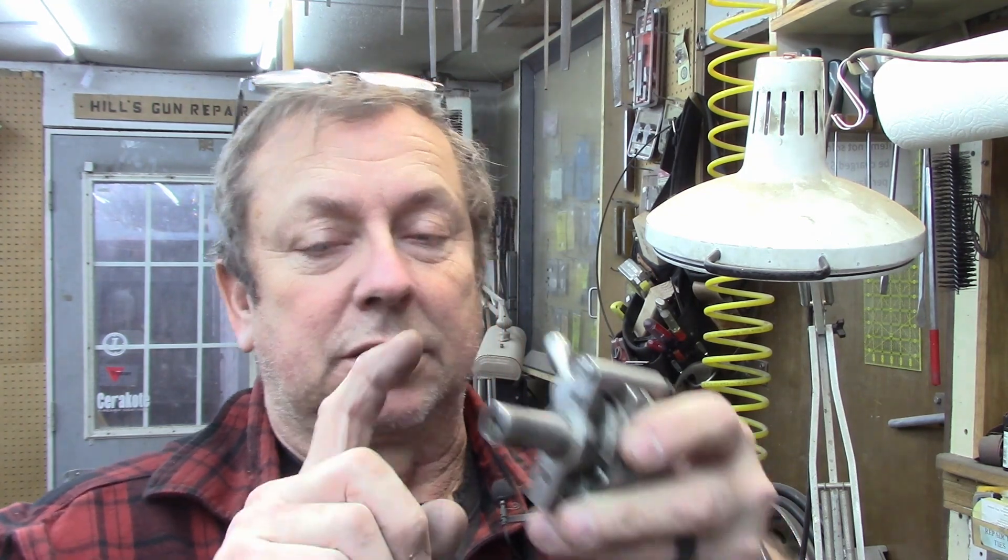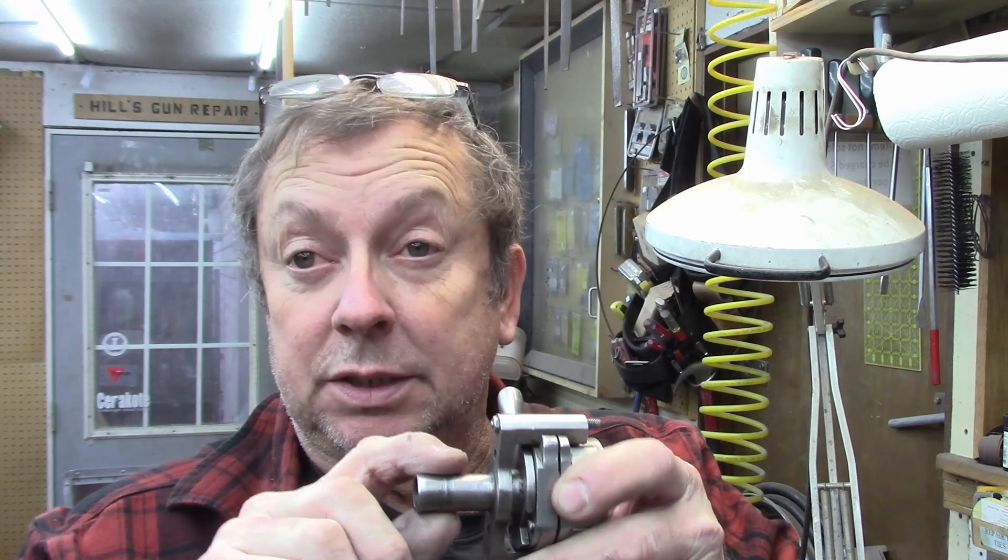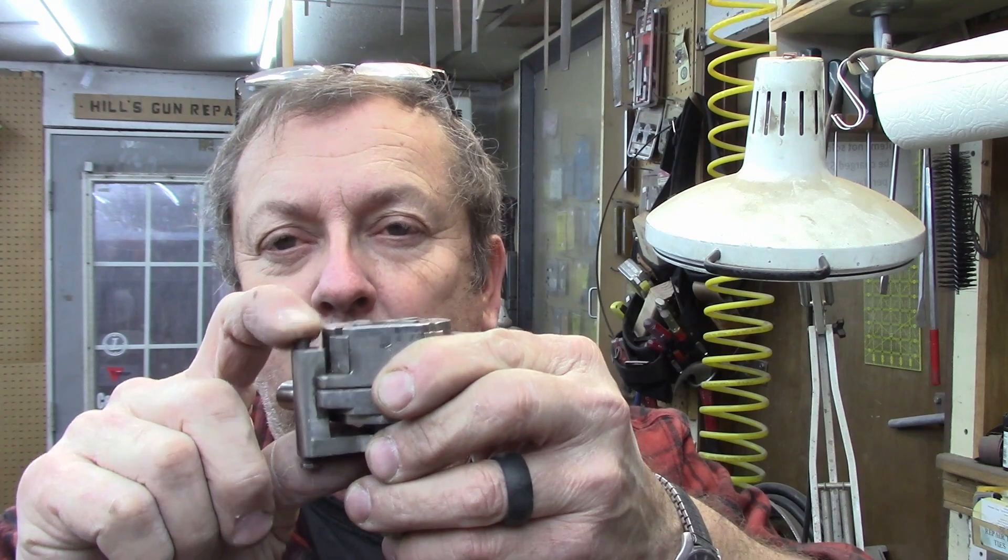The proper way to do it would be with a self-releasing die head like a DSA. I've got one but I've never set it up and used it — it needs a little bit of work. It's got a 5/8 shank where I need a 3/4-inch shank for either the Atlas turret lathe or the Logan turret lathe, both of which take a 3/4 shaft. I'm probably just going to sleeve it. It also had the release broken off when I bought it, and it's only set up for quarter-inch, so it's not big enough for the threads I need to cut.